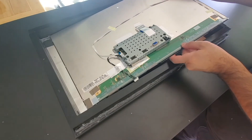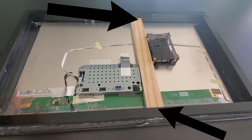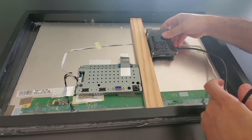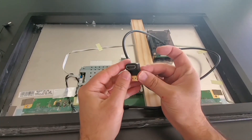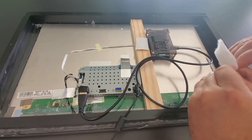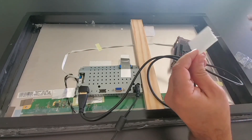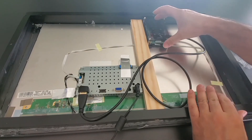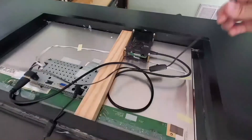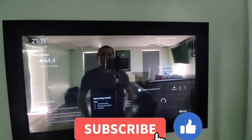The next day, I placed the LCD screen inside the frame and secured it in place using a board. Then I connected all the cables to the Raspberry Pi. Depending on the depth of the frame, you may need to use an HDMI 90-degree L-shaped connector male to female adapter. The last thing I had to do is use some Velcro strips to secure the Pi behind the screen, connect to power, place it on the wall, and just like that, I have a smart mirror. I hope this gave you some ideas — let me know what you think. As always, thank you for watching, catch you next time!